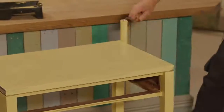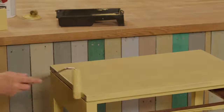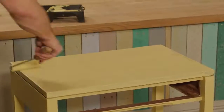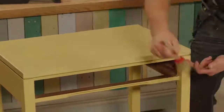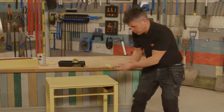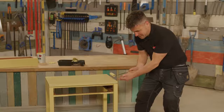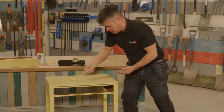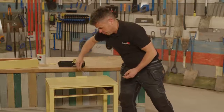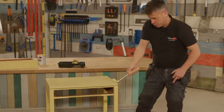It's not a problem if you get any paint onto the actual side — just feather that out with your brush and it will dry nice and flat. Also when using the roller, what we don't want to do is start at the very end of the roller along here and catch that lip. So we start in the centre and spread the paint out — when coming to an edge, we mop it that way.